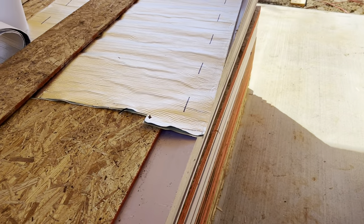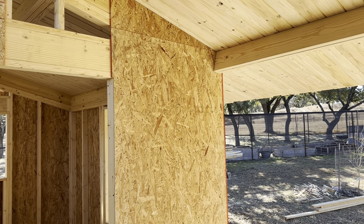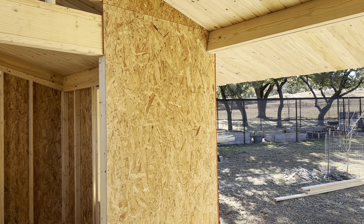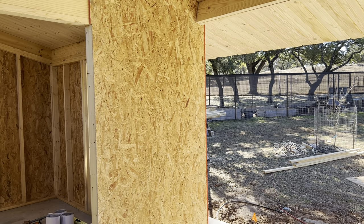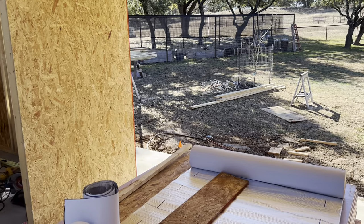What am I going to do on this building? If I cover it all with membrane and put all the insulation on the outside it will cost a little bit more. Since this is a garden shed and a solar shed, I'm going to go for a compromise — though this is not a compromise I would ever recommend for a residential building where people are living in it, a large building that creates a lot of energy demands. We have a lot of perimeter footage but not a lot of square footage.